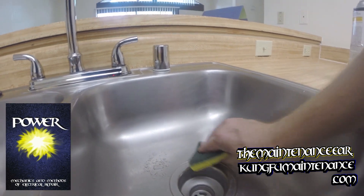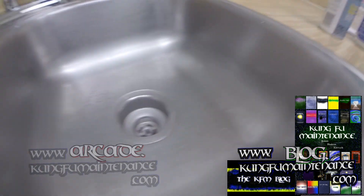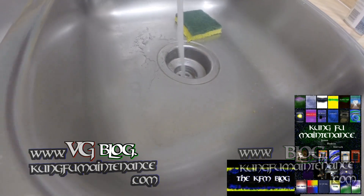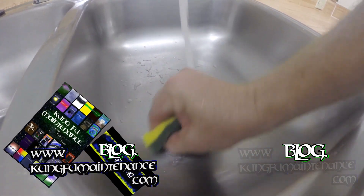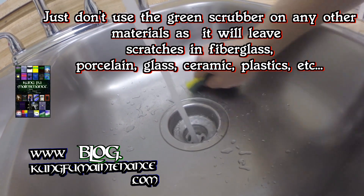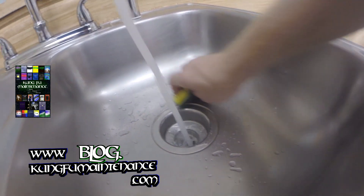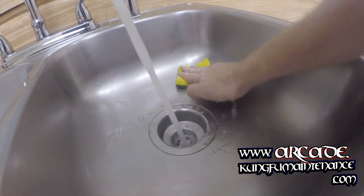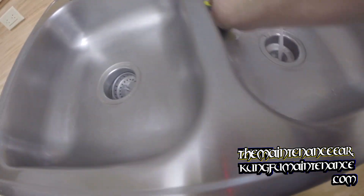For stuff like this, I'll show you on this side - it's just not going to clean out. It kind of rubs out but you still have the marks there. What you want to use is the green side, and you can use any number of cleaners, but you're going to use it like sandpaper and just sand the mark right out. This is called re-graining the sink and it definitely makes a huge difference - makes the sink look like new.